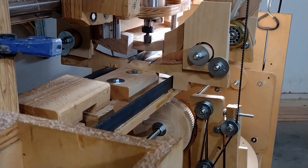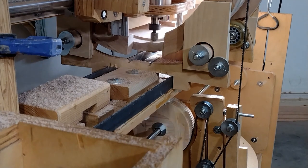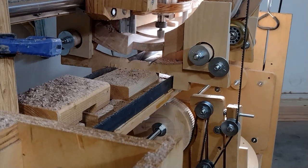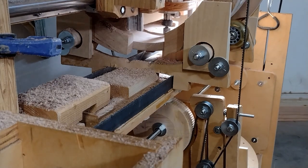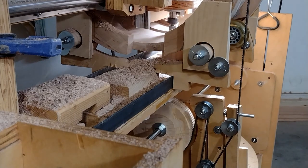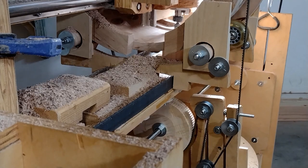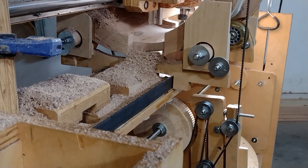In the past when I skimmed the outside of the drum I could only take off 30 thousandths — 0.03, three hundredths of an inch — not very much. Now with it held much steadier I can be much more aggressive and get a better finish in the end. I didn't measure the exact amount I'm taking off here, but it's probably close to a quarter inch to get the final pass done — so much faster in the end. I don't have to take as many passes, more aggressive, and a better finish in the end. It's a win-win.